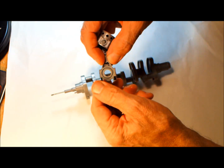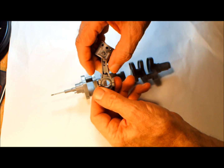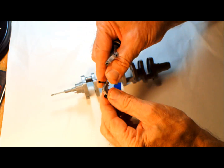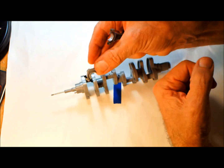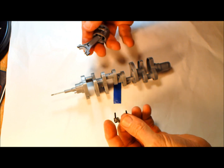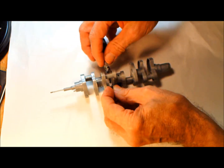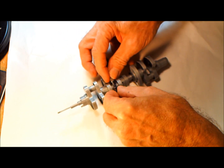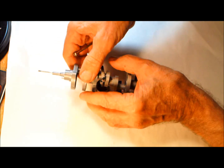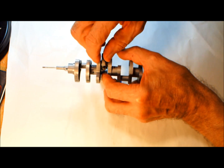What happens is this is split. The stock rods are split, and you have Teflon inserts inside here, and you have two screws, and these are nylon screws right here. These are 2-56 nylon screws, and you have to line these up. You have to make sure that you get them back together right. I've got them marked here, and you just put that on there like that, and then you just tighten them down. Oops, gotta get it on straight. Helps to get it on straight.